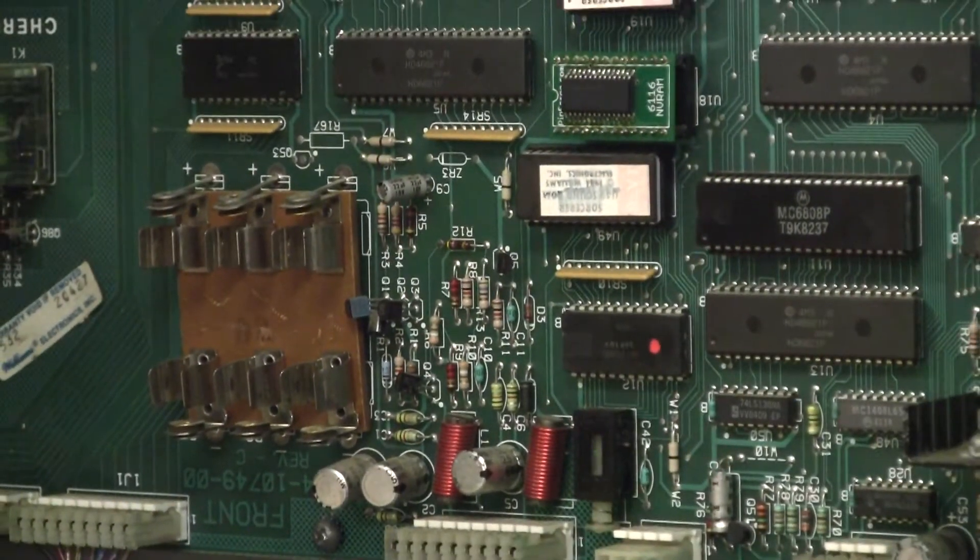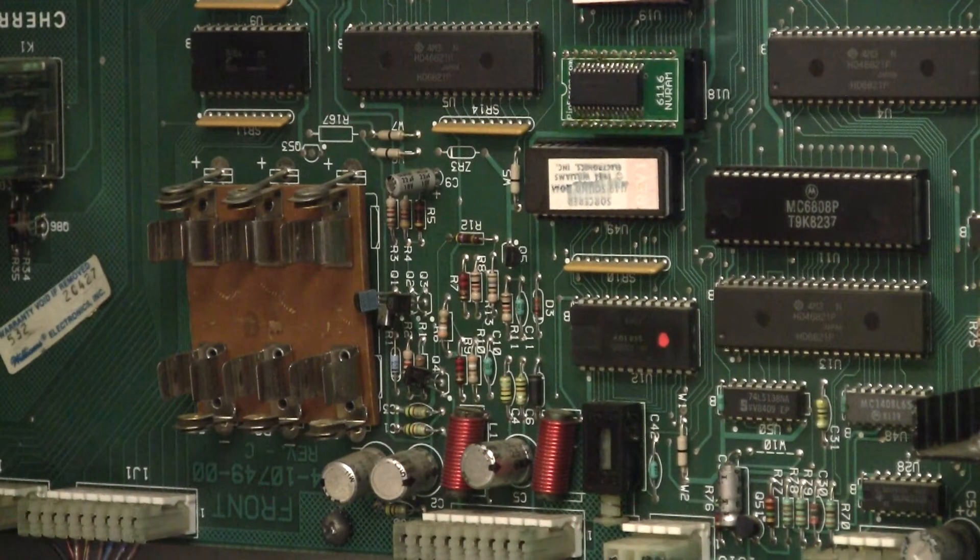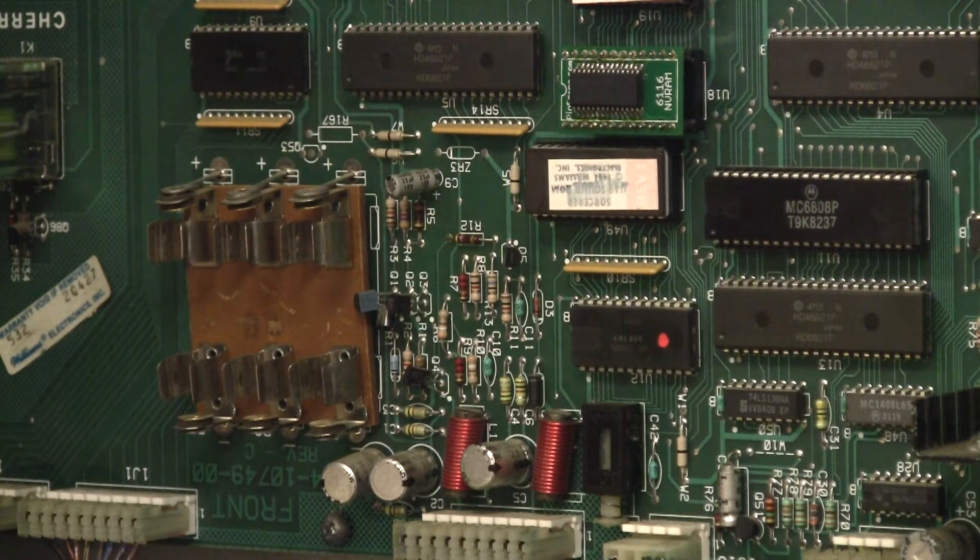You'll notice that there's no batteries in this game. So what this video is also going to talk about is how to convert these games so that you don't have to use a battery in them anymore. Instead of using battery backup, we're going to use a RAM chip that is non-volatile — it will remember the data in memory without batteries and doesn't need to be powered up. So we don't have to worry about batteries on the board leaking and causing problems. It just so happened that this game had a problem with the memory, so it was a perfect candidate right away.